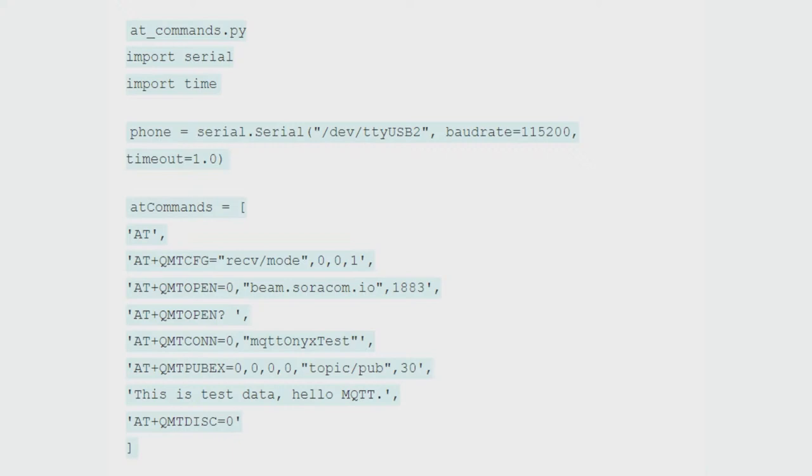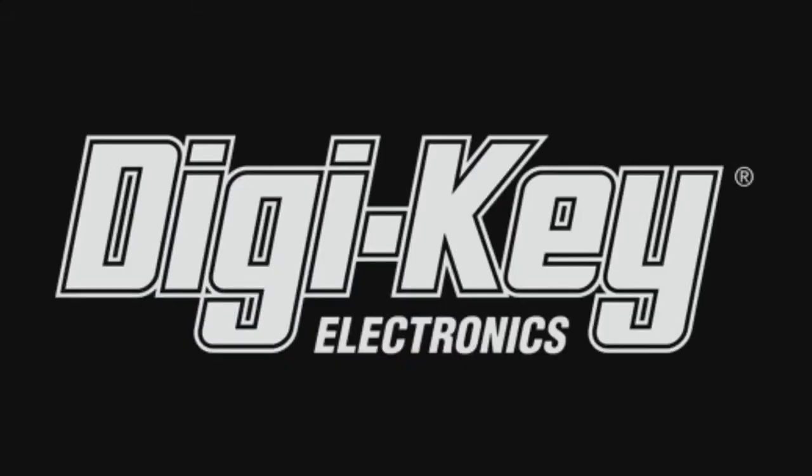Then you can use their web interface to the MQTT broker to see that the data was published. So again, if you don't want to use a full TCP/IP stack because you want to save power and bandwidth, there's nothing lighter than just sending the raw commands. It does the bare minimum: connect, send the data, and disconnect right afterwards.